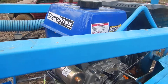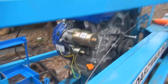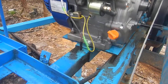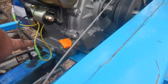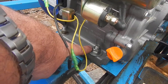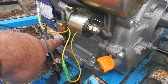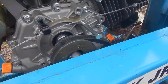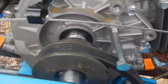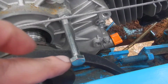Boardwalk conversion from an 11 horsepower to an 18 horsepower motor, part two. If you look down there you can see we've got our two bolts. This is one of the bolts that came with it and this is a new bolt. Notice it's a slightly smaller size, so you're gonna have to change out two bolts, and this bolt configuration right here is just exactly the way it was before.